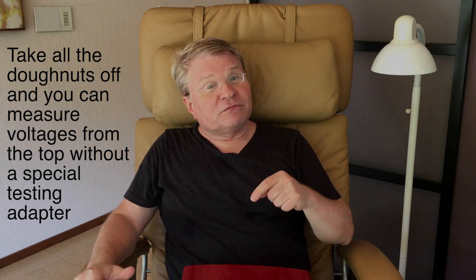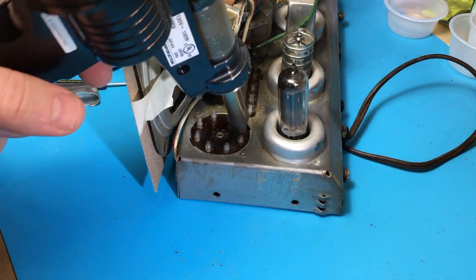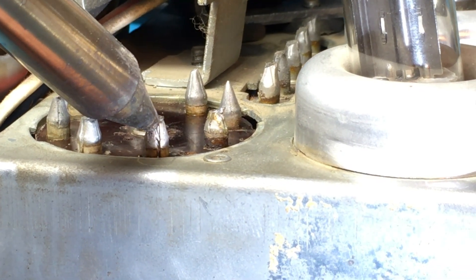For a person restoring a radio, it could be a little bit of a pain. But it's okay for me because I have one of these nice Hakko desoldering guns I've had for a long time. If I put that on top of the barrel and hit it, it heats up and sucks most of the solder out — sometimes I have to go underneath the bottom to pick up a little bit more, but then I can just pull all the wires right out. Re-soldering it back up, you just put a lot of heat on it and dump solder back in. I also wanted to see if there were any components like capacitors hiding under there — so that was another reason to do it.